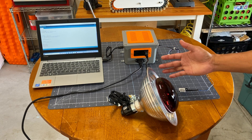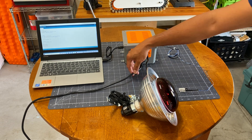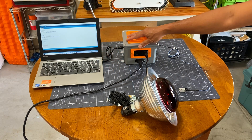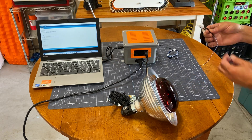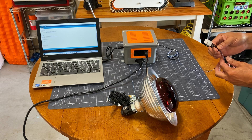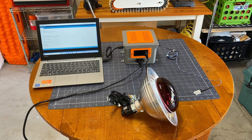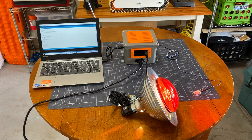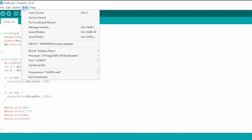So this is a heat lamp plugged into the outlet of this control box, and the control box itself is plugged into the AC supply. We have a laptop that monitors the temperature, and this is the temperature sensor itself — the DHT22. When we turn on the device, the lamp will turn on and the sensor will detect the temperature. You can make use of Arduino IDE's serial plotter to plot both temperature and humidity changes.